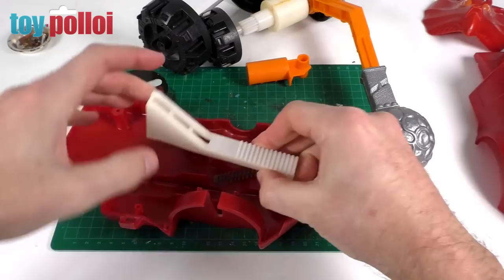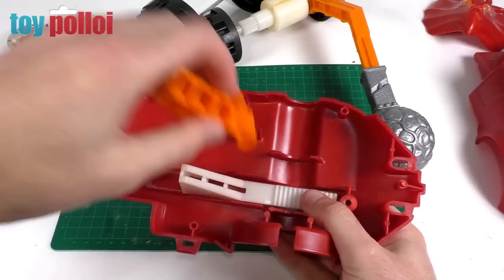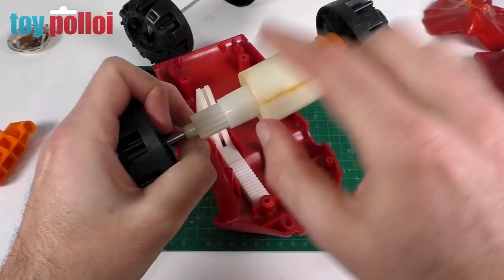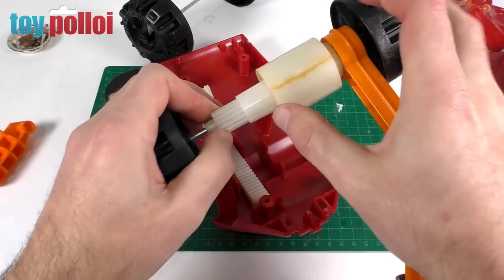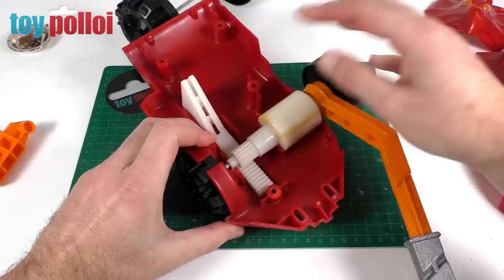Yep, there you go. So now you can see that lever, when it is pushed down, actually pushes this backwards, and that is what drives the arm to swing forward. So once that's in, we can now put the arm in. So we're bringing that whole wheel section. To get this in, you can see that this middle piece here is slightly spring loaded. You can see I can push that in. There's obviously a spring inside here. So you need to push that bit to the right hand side, and then you can get the wheel over the arch and it will get into place there. And then that should just drop in, and that spring loaded piece just needs to clip behind those there.